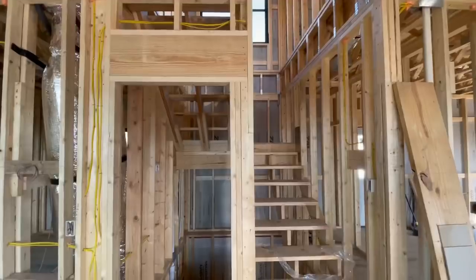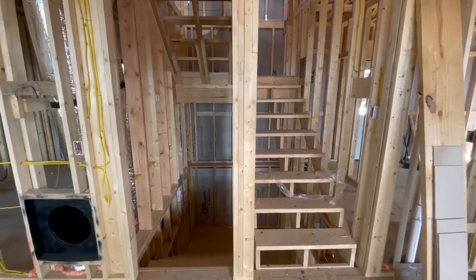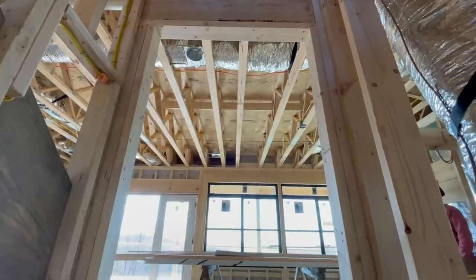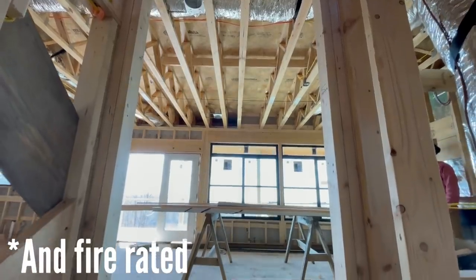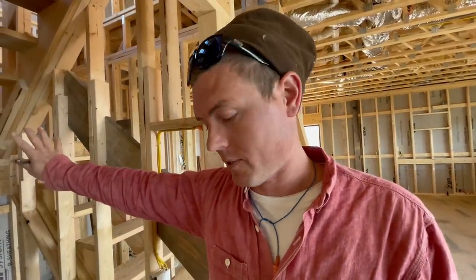Saw cut. Okay. Drop. This door right here leads into the basement. In this house right now, this basement is unfinished and it is also unheated. Therefore, the building code and the inspector requires of us to install an exterior door here. This door has to be insulated. It's going to be probably steel faced. It has got to have these gaskets all the way around the door as if this space is outside. That's how they treat this space.